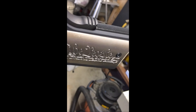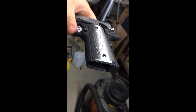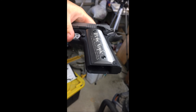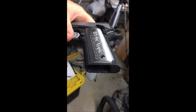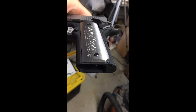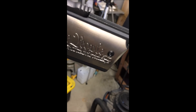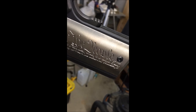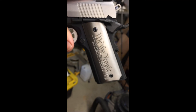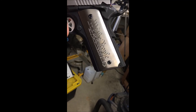Just a little bit of funniness on this as it ramps down this back side. I guess when it would be machining this side — looking at the screen from right to left — it would be climb milling, and going from left to right after it goes down the ramp is actually conventional mode. The way it changes the chip load, it doesn't quite have as perfect a finish as the front side. So I might mess with that a little bit more and see if there's a way to optimize that, but a little bit of deburring takes it out.